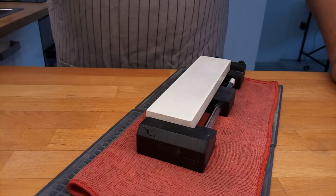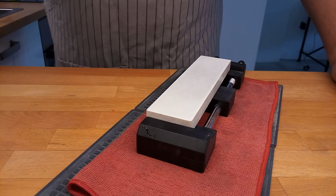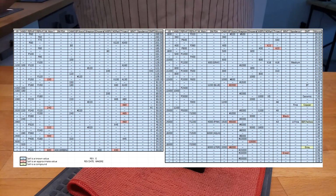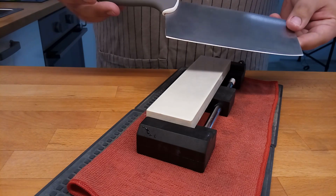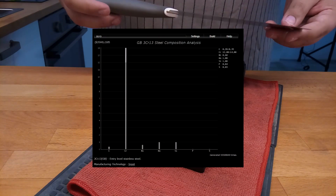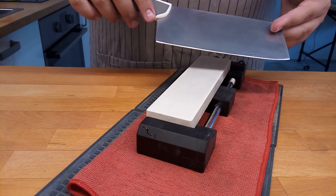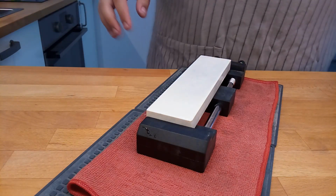So after checking the flatness and lapping the new Missarka by ZISCHE abrasive, aluminium oxide sintered FEPA 1000, Japanese industry standard 3000 stone, the first use. I'm starting my work with an old familiar 3CR13 MOV, molybdenum vanadium, Chinese vegetable cleaver, branded by IKEA and for sure produced in China, between 50 and 55 on the Rockwell C scale. Very common type of kitchen knife.